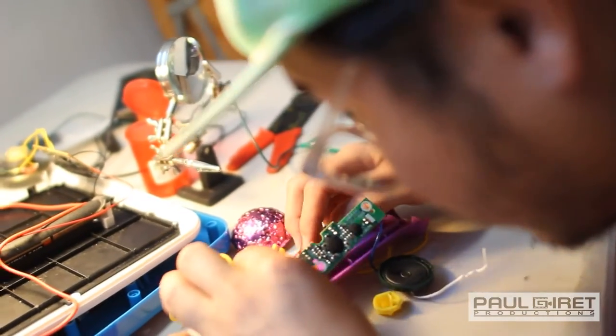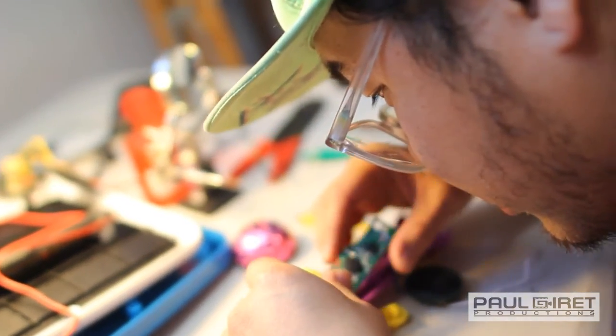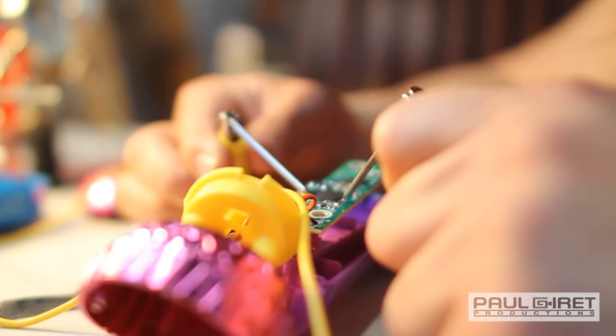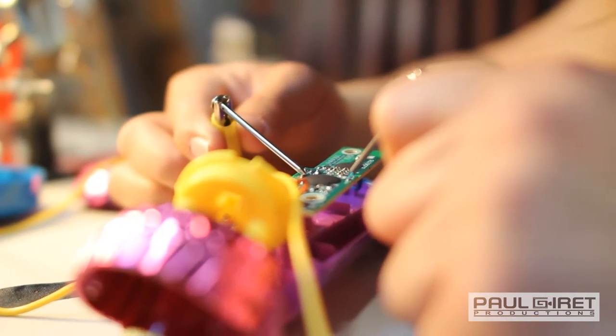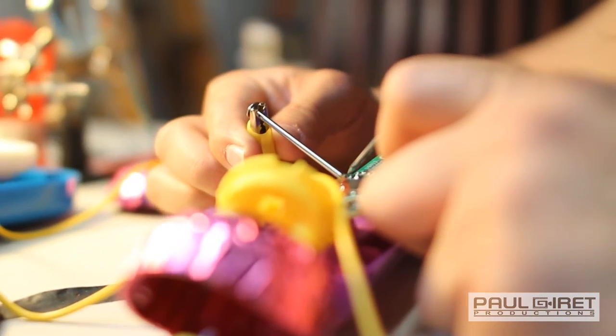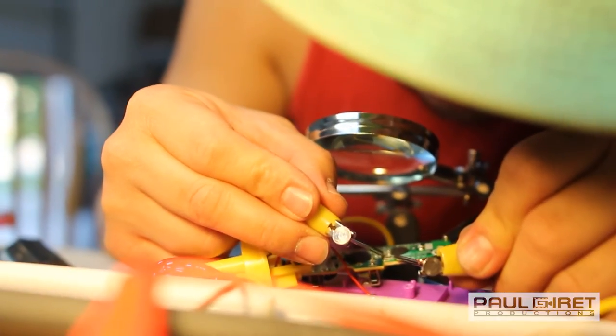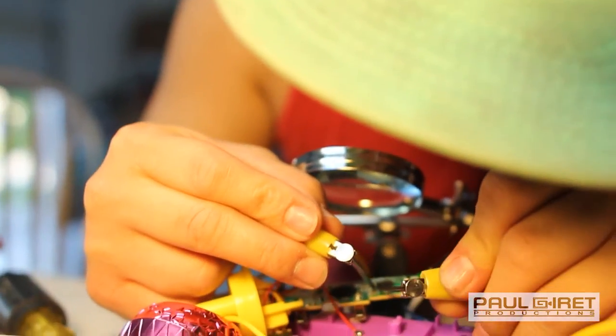There are so many screws that hold these things together, so it takes a little bit of time. You gotta unscrew them. Once you get them unscrewed, that reveals your circuit board. Once your circuit board is in the open, you need to find your probes, and you start to probe the circuit board while you're activating whatever sound that it does. As you're probing while the sound is activated, eventually when you put two probes in a spot, you're going to manipulate the sound in some way.